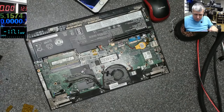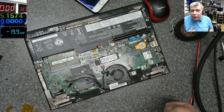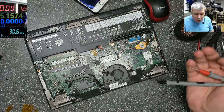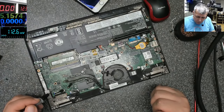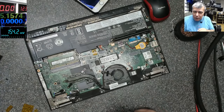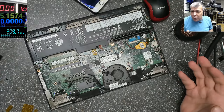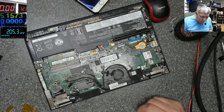Let's check together. I can't explain how a coil can get hot, because even this power supply has its own protection. But let's say we have a shorted MOSFET. You have this protection. You have here two MOSFETs and the carbon resistor, the current sensor, which has nothing to do with the other power supply. So it's weird. And let's say the MOSFET is only partially shorted and the current is not going so high, and that's the reason why the coil is getting hot. Can be weird, but can be okay.